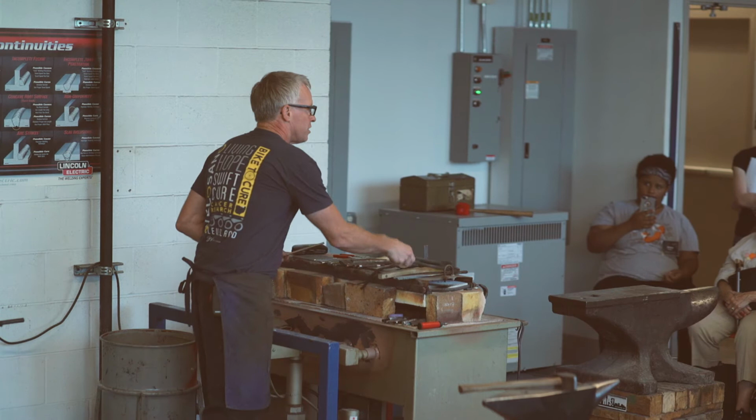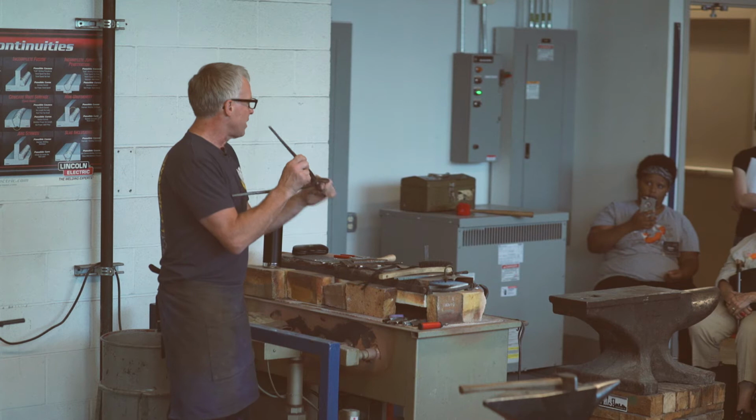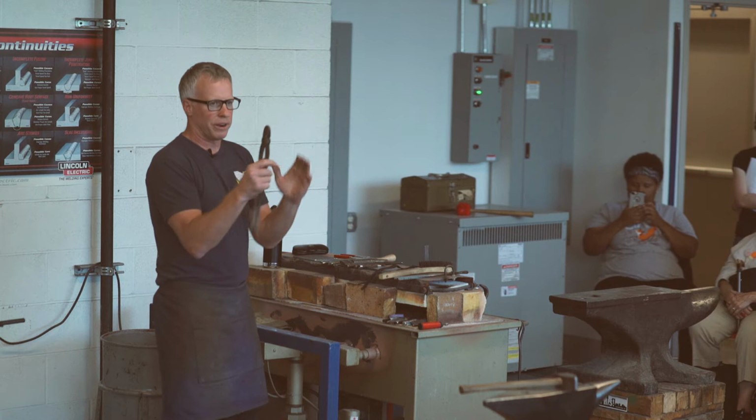And then for sheet work, these guys. These are farrier's tongs. They hold horseshoes, but they also hold sheet and plate really well. They do that really well because the center is hollowed out, so it's grabbing around the edge of the material. If it was dead flat, it would wiggle around and it wouldn't stay tight in there. These are great, and I have these ranging from eighth inch up to like half inch, this gap where they close parallel to each other. These are fantastic tongs.